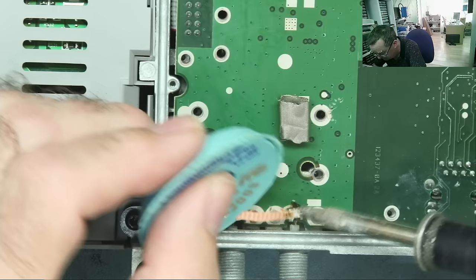Obviously, you can't necessarily say because they are in circuit, but this is the red meter lead, black. Reads like a diode, other ones are the way up, so red here. Reads like a diode. And then from here to here, which you think is base emitter. Okay, 2 volts or there, but let's go the other way. That reads different, but there again, it may just be out there on circuit. This is red lead to here. Okay, then we go the same on the other one. Reads completely different.